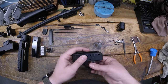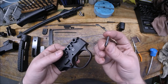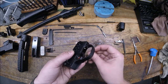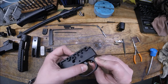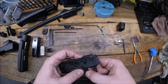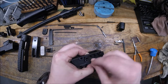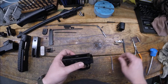Before you go and do something stupid, remember the return pressure is done by this detent and spring, which we've got to make every attempt to not lose in the process. So this spring doesn't try running out on you too bad. It's pretty simple to manage, but we'll get the trigger lined back up here. And it all stays pretty well in place. It's not that hard to fight that spring. But yeah, get your pin in like so, and it'll work.